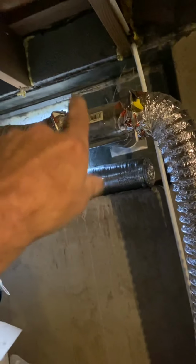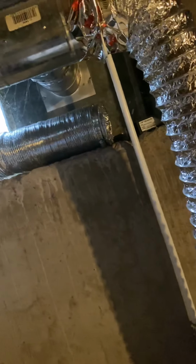Okay, our vent will vent out 2-inch PVC to a flat termination. And he's got this dryer vent here, which is obviously illegal. I told him that this is really illegal. But anyway, so a 2-inch PVC to a flat termination at the back.